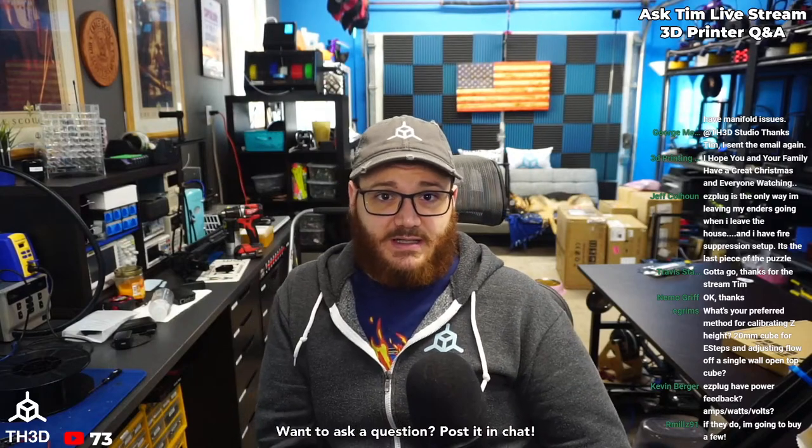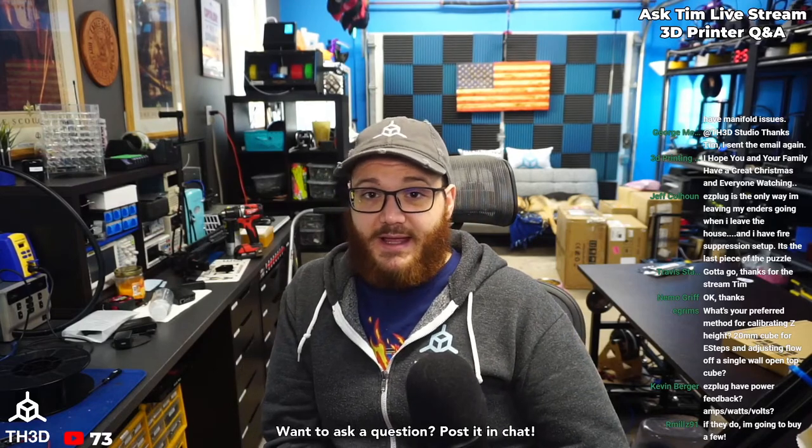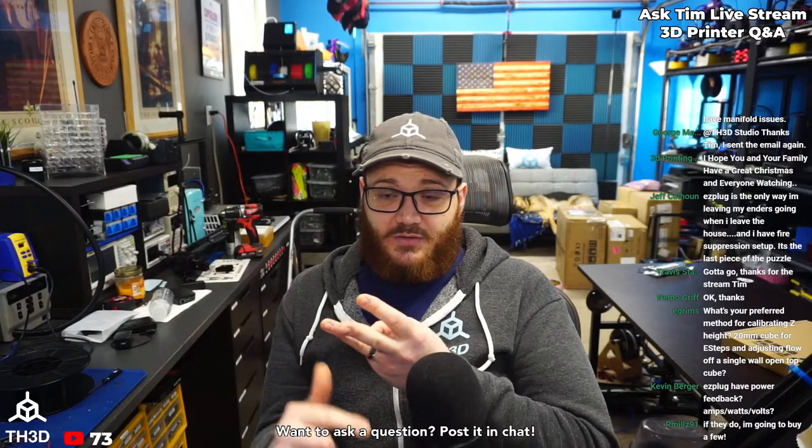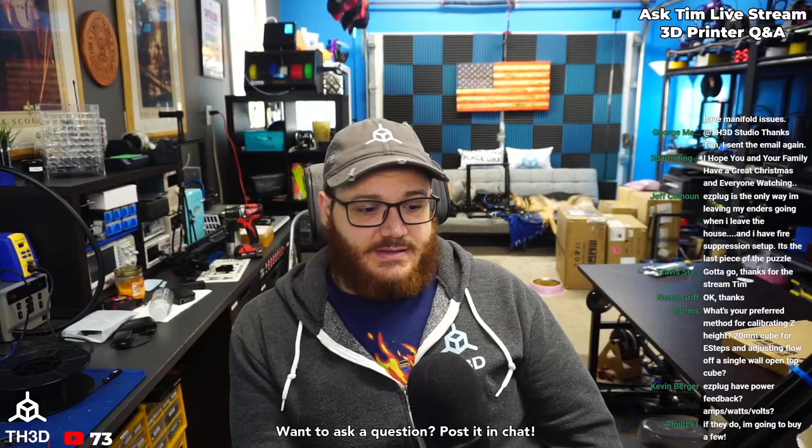Kevin Bird, do the Easy Plug have power feedback, amps, volts, watts, etc.? So there's a standard one, which is the $19.99 one, and there's a $24.99 one. The only difference between those two is the $24.99 one has power monitoring features. So watts, amps, volts, and the VA, as well as power factor. So it has all those. And that data can also be fed into a system like Home Assistant to actually log your usage on that machine. So we're going to have both. There's one that people just want on-off, and there's also on-off with all the power monitoring stuff.